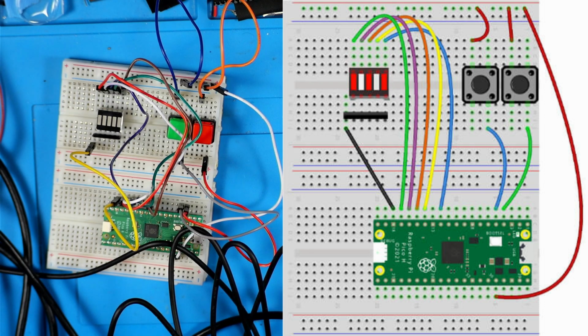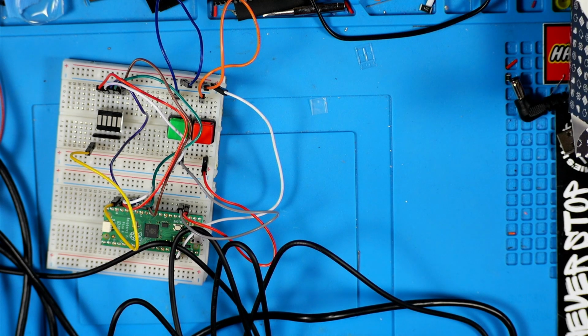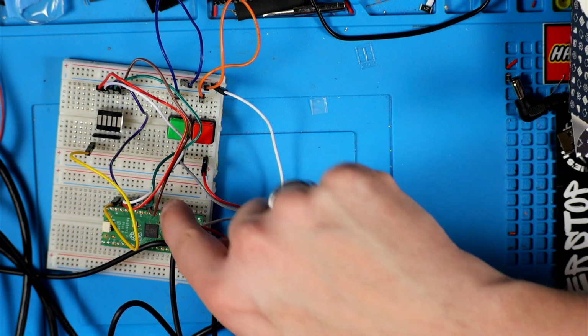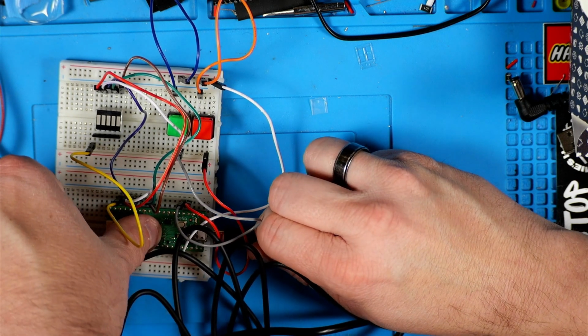What's it say? Main things to check: double check your circuit before plugging your Pico in. Check that the flat edge on the display is on the same side as the network resistor. The network resistor dot pin is not connected to the display. Wire the Pico correctly, including a gap between the first GPIO pins and the last one. Got that right? Yep. Let's see, what's this new code supposed to do?